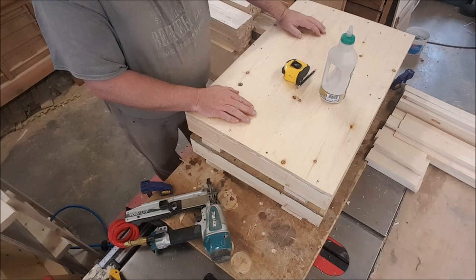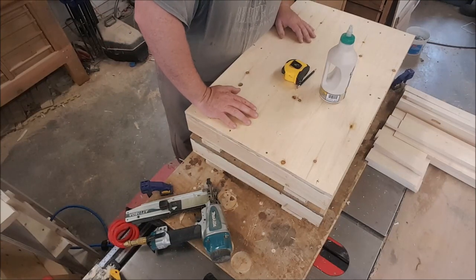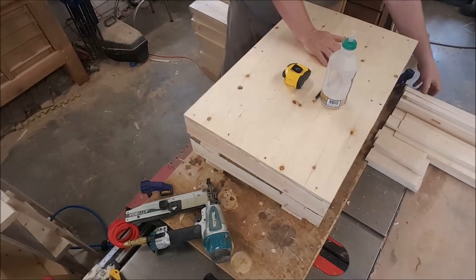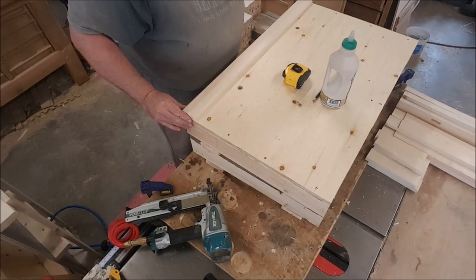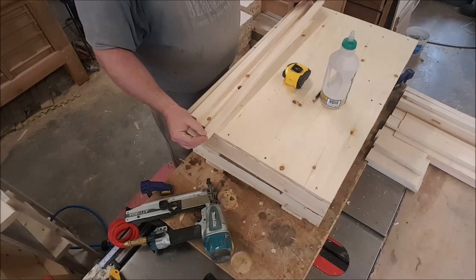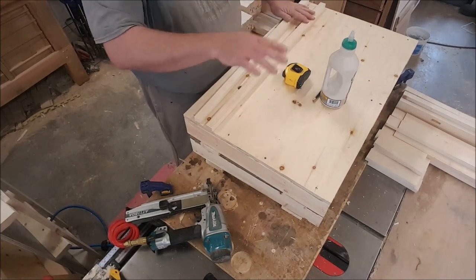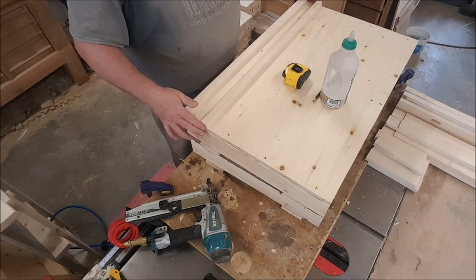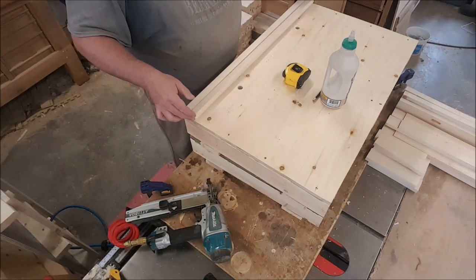So I have 7 pallets to assemble, and I have 4 different parts for each pallet. For my first part, I want it set. These are all 1 inch wide, 3/4 inch high pieces. So it's going to make a 3/4 inch high shim around the bottom of each box. I want this shim set back 1 inch. So I just use the next part and flush that up with my thumbs. I'll glue and staple that down.